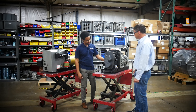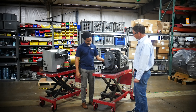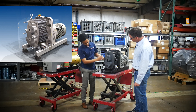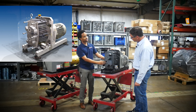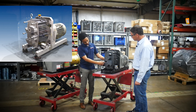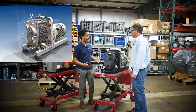These are counter-rotating lobes and you have your inlet here on the port. As these rotate, air is moved from the inlet and compressed on the discharge side. The main feature here is that you have internal compression on this pump, and that's what differentiates it from other pumps. This internal compression squeezes that air outside and that's where your compression ratio is created.